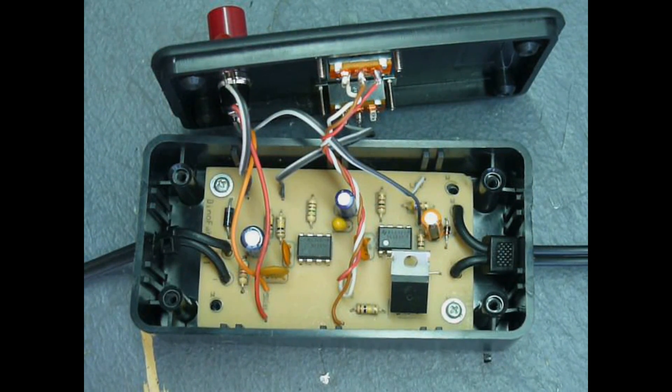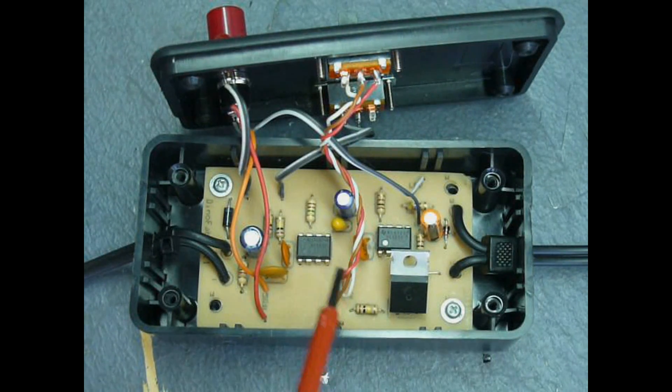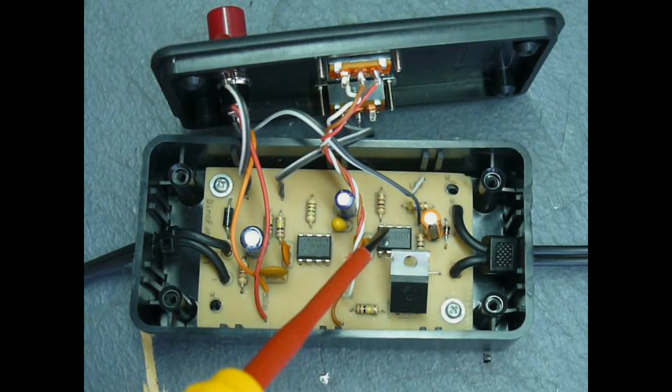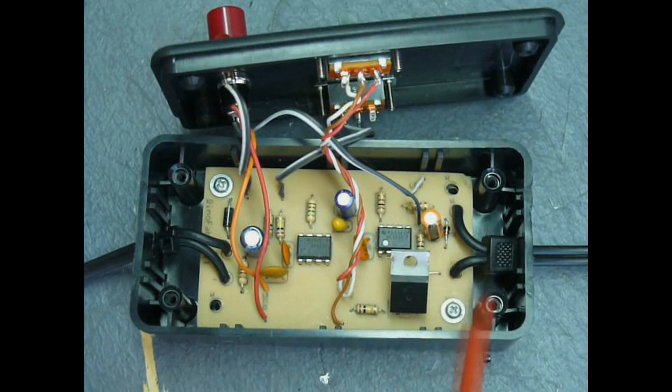Here's my final entry in the 555 contest — my fuel injector tester based on two 555 timer chips. It uses the monostable circuit and also the astable circuit. The monostable circuit puts out a single pulse which goes to the astable circuit. The astable circuit outputs the pulse train through this MOSFET and to the fuel injector. 12 volts comes in, runs through the circuit, and gets output as per the circuit. Today I'm going to package this thing all up, take it up to my car, connect it, and show that it works for its intended purpose.